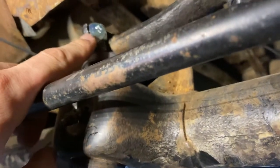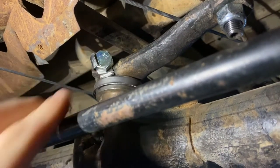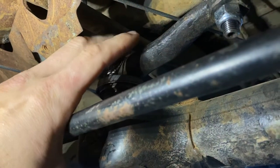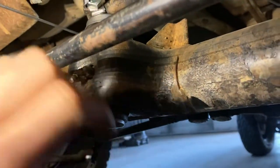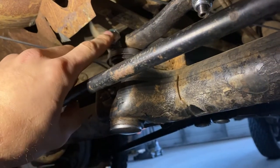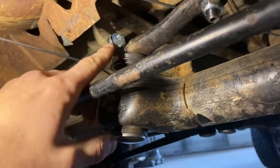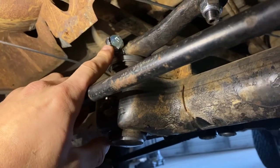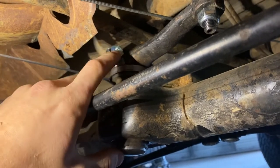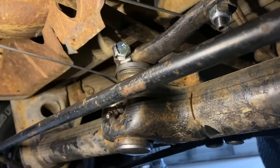This shiny bolt here is not the bolt that came in the kit. That's because I did not have enough clamping pressure on the swing lever arm itself to the bottom of the center pin. It was stripping the bolt — I stripped the one that came in the kit and I stripped the original one too. I had hell finding this bolt because of the thread pitch. This is an M12 by 1.5 thread by 50mm. I checked five places and had to go to a specialty store about 20 minutes away to get it because of the thread pitch.